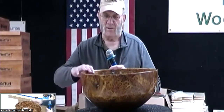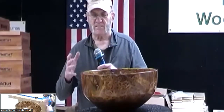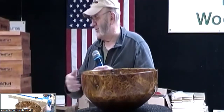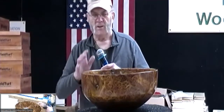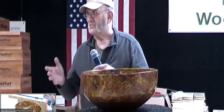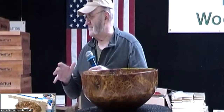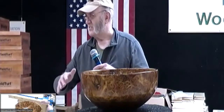So while we're now able to turn this, you start putting epoxy on. You mix about 5 ounces of resin to do each side, essentially. It'll drip, run, and be a mess, but it's going around while you're smearing it on. So you get one coat done, you let it dry about 4 or 5 hours, and you can come back and put the second coating on top of the first coating, and you've not sanded any, right? You're just getting it on.